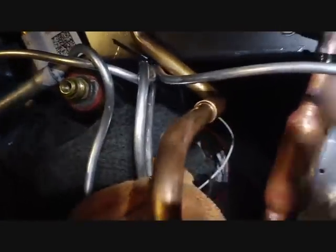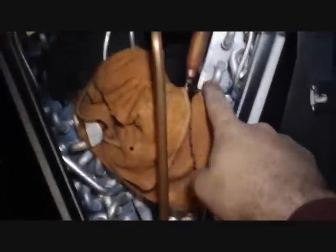We have to take this cap off and it's soldered. You can see where it's at — it is mixed in there pretty nicely. I've got the nitrogen hooked up here to blow through the coil while I'm taking that cap off so I can set up those initial connections.